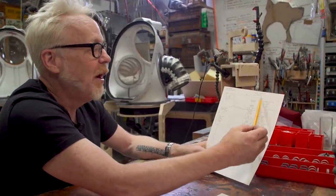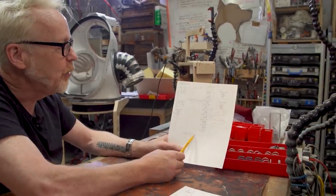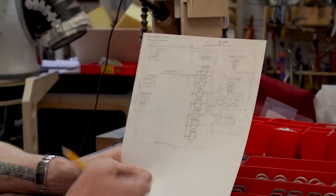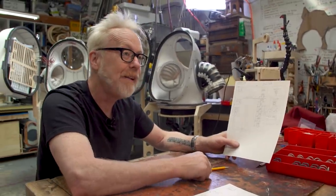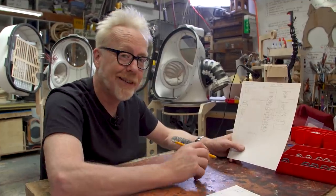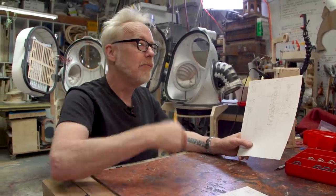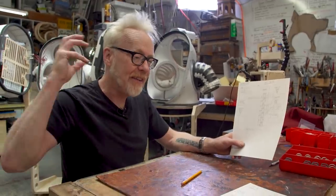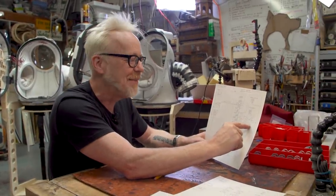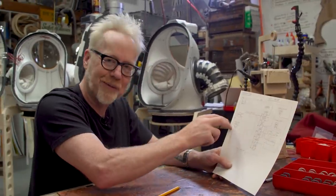So now when I draw the wires across here, I end up with what fills this pill here, which is the four leads I need to run between the two doors. Now I put in 3 4-pin DINs, and it turns out right now I only need one. That's crazy. Now, I may end up with needing to run more for the PA system because it's gonna have a speaker, and I'm gonna wanna put the speaker behind me so that it's not in line of sight of the microphone. And that means I'll have to take the speaker from the PA system that's here and run those two wires back over here.